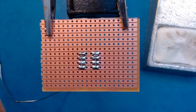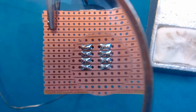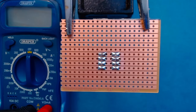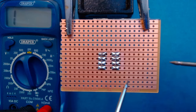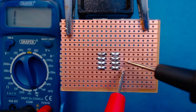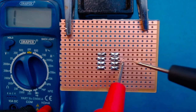After soldering, you can bring in a magnifying glass to check that none of the joints are touching and that there are no dry joints. It's also a good idea to check as you go along for short circuits — tracks that are joined together that shouldn't be. Set your multimeter to the continuity setting; when you press the probes together it makes a beep. Test each adjacent track pair — if there's no beep, there's no short circuit between them.